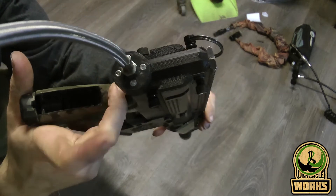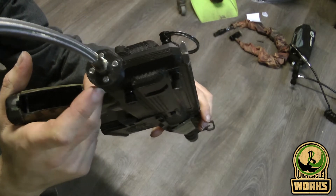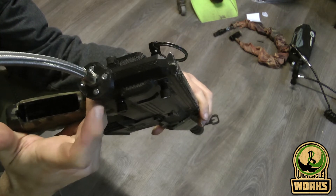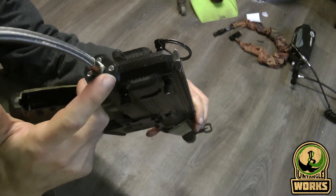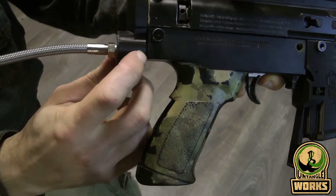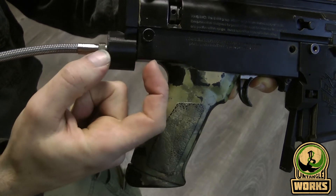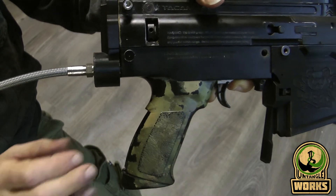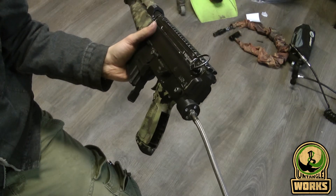I now made it thicker, and I also lowered the fan speed during printing, which may help with layer adhesion. What you can also notice is that I installed some bolts — those will go all the way down so they grip all the layers together. That's at least the idea. We will see how it all goes.